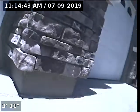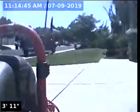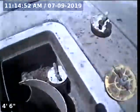Express Sewer and Drain here, 5959 Tana Circle, Rocklin, California. Doing a main sewer line inspection through Bullhorn cleanouts. Going into the home is 3-inch ABS, going downstream is 4-inch. We're going to start off by going into the home first, through the 3-inch Bullhorn.